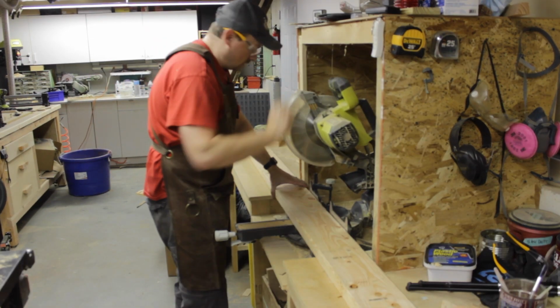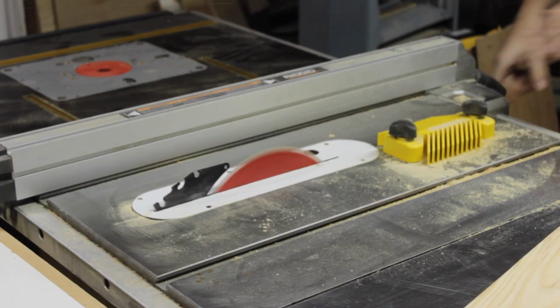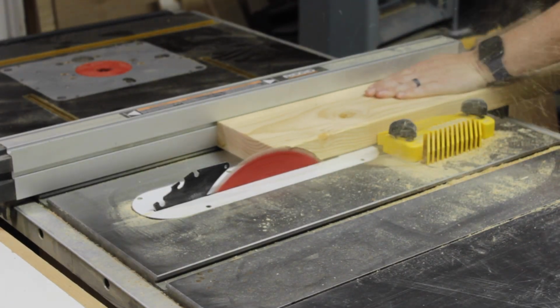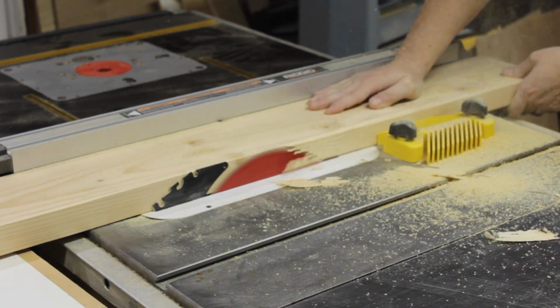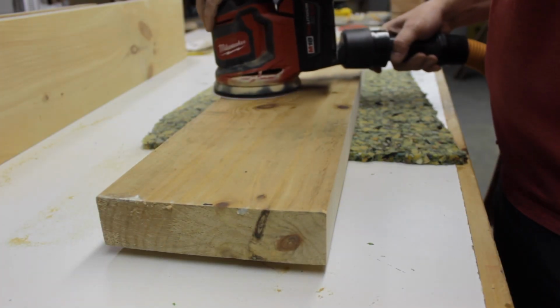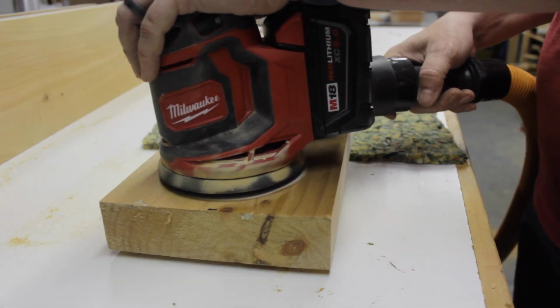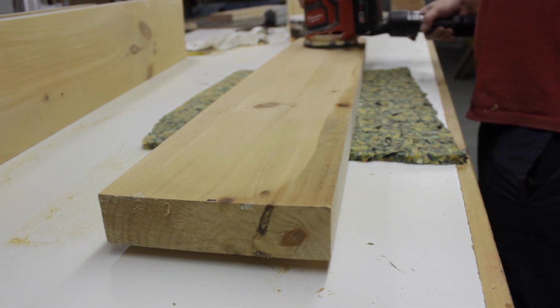So we're gonna build some shelves, starting with some 2x6 construction grade lumber that I got from the big box store. In total, I'm making 8 shelves, and they're gonna be various lengths and depths, just to give it a more 3D feel when they're up on the wall. I'm also cutting off those rounded edges that come on all the regular construction grade lumber. I want that square look to reflect more of a Lego block feel.